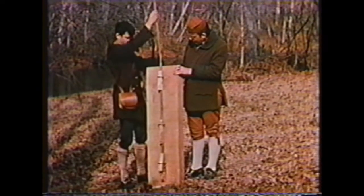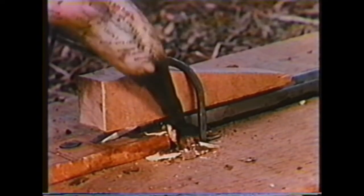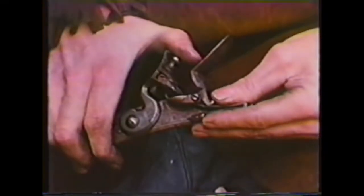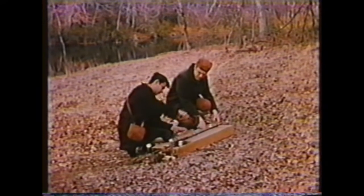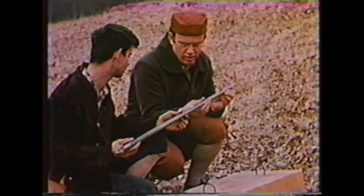In normal use, if you fired that amount of powder on the weapon, there would be such a recoil that it would most likely break the stock. We use an old lock to fire the powder train. The barrel is inspected for cracks and swells — these would mean it's no good. Later on, it will be taken back to the shop, unbreached, and checked inside.